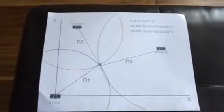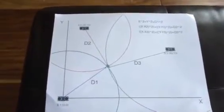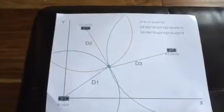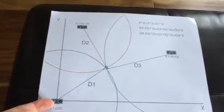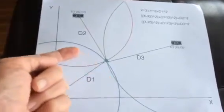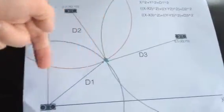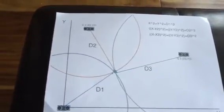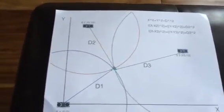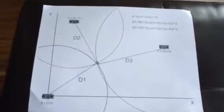It's based on the idea of trilateration. The way that works is you take three distance measurements and compute an intersection point. You put one sensor at the origin and find the distance, then move to another position and take another distance reading. The intersection of two circles gives two points, and then you take a third measurement, and the intersection of all three circles gives the single point.